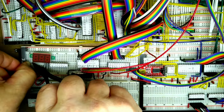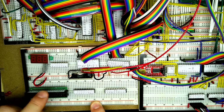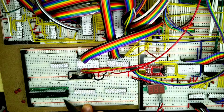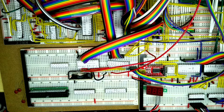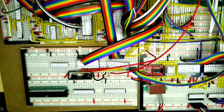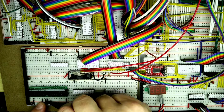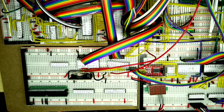So let's just replace the breadboard buddy, connect the two breadboards together, put in our breadboard buddy, and make sure the chips are in. I'm just going to hook up the ground and the plus 5 volt lines for all the chips and put in the decoupling capacitors close to the ground rails. Then we need to do all the IDE connector ties to ground, so it's quite a few ground connections, and there's also 1 or 2 pins we need to tie to ground as well.